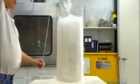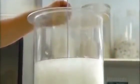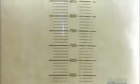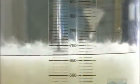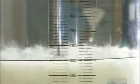After processing, the factory's lab tests a sample from each batch for cleanliness. Technicians also evaluate loft, the technical term for filling power. The higher the loft, the better the down will insulate. They measure how much space the sample fills. If the down meets specifications, the factory bags the batch for shipping to the duvets factory.